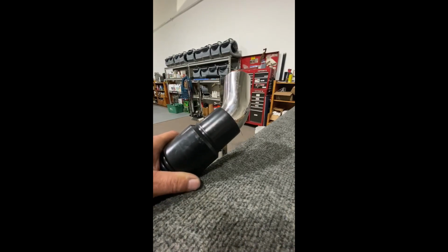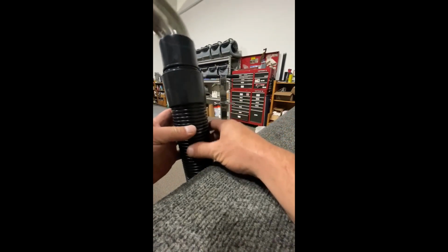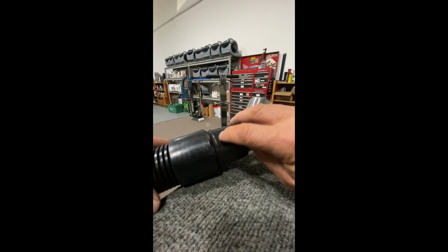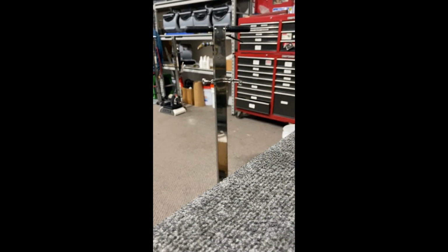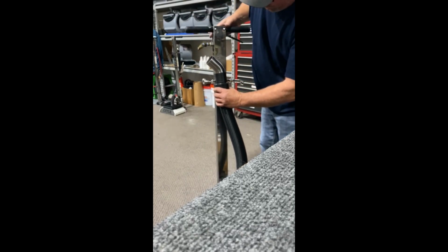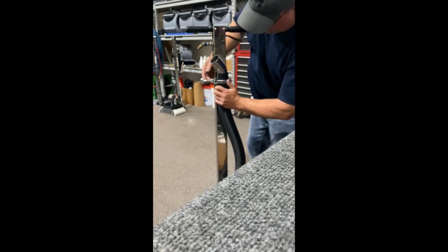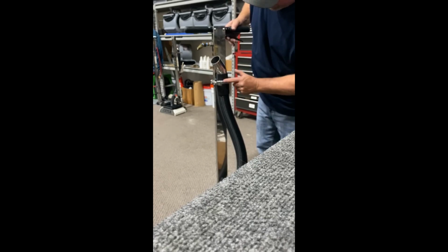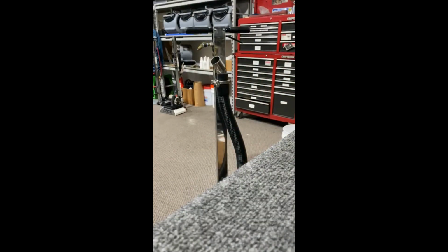Here's another issue I'd like to address. A lot of guys, there's a clamp that holds the cuff here, and a lot of guys are putting the clamp around the hose, and the hose is ripping because it's moving. The proper way to do this, do you see this little ridge right here? This ridge goes inside. Let me bring this in a little bit closer here. That ridge will go inside of the clamp. So when I'm clamping this, you put it to either side, whatever side you want. When I'm clamping this, that ridge sits down inside of this area here, okay? And then we put our clamp on. Now I can't pull it. Even though I didn't even tighten it, I can't pull it because I have that lip inside of this clamp. Might be a helpful tip. Keep you from ripping your hose, and we're gonna finish putting this together and go from there.